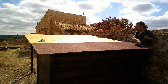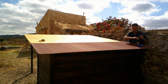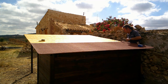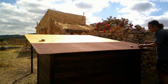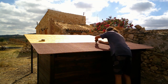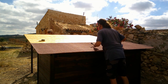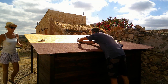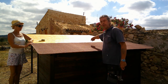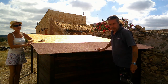Just got to check inside to see if they've come through. What we want to try and avoid is nailing through the surface that's going to have bitumen over it — the adhesive stuff. We don't want to nail through here. What we're going to do is bend it over and then nail all down the sides. So we'll crack on and get that done.